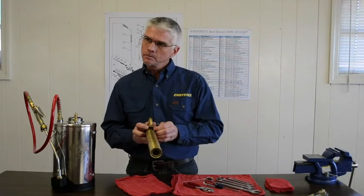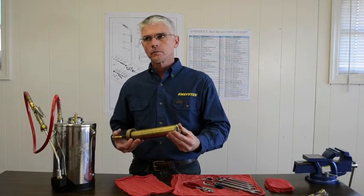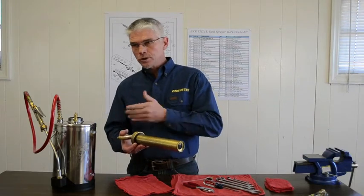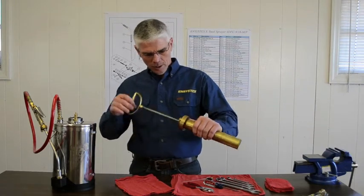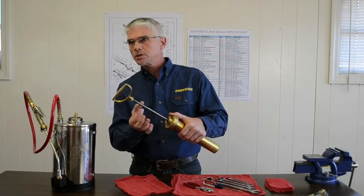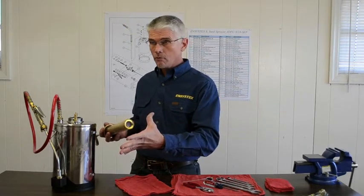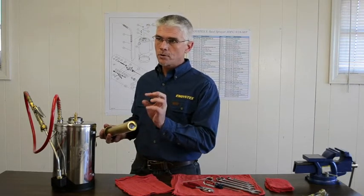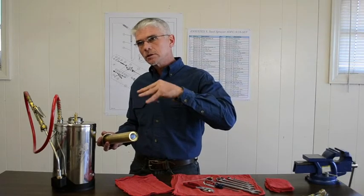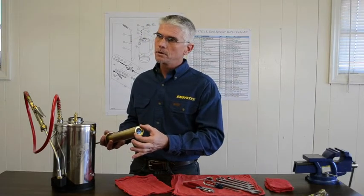But now, from what you said, I should never see any liquid inside that cylinder. No. If I do, exactly, then there's a service issue. That's right. If you ever drew material up into the cylinder itself, it's going to come out through the entry hole that pulls the outside air, as well as between the piston rod. That's going to be a direct indication that your non-return valve has either fell off or has cracked, broke, or in some cases over stress and strain over time. That thing can lose its tensile strength, if you will, the ability to seal at the bottom of the cylinder.